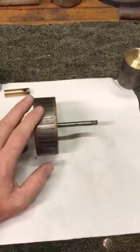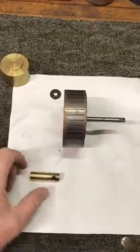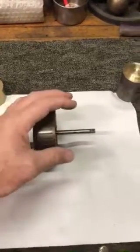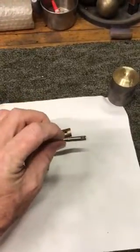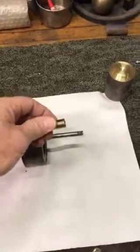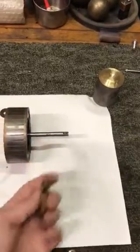The pancake style motors had a single bearing like this one — it was quite long, and the rotor came in from the back side of the motor. The bearing rode here, and you can see where the wick comes up out of the oiler on the bottom side, comes up and rubs against this shaft.